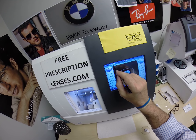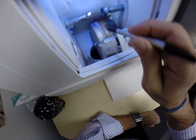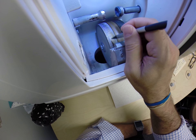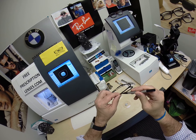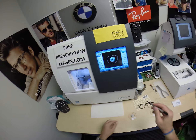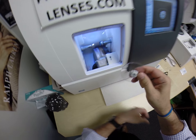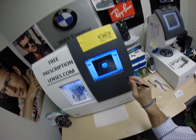I'm going to wake it up. That's job number 1478. The actual cutting wheel is this diamond-crusted wheel that's going to grind away your lens material until it's the final size. This wheel in the center is going to put the V-shaped bevel onto the lens so it stays inside the bevel of the frame. I'm going to go ahead and let the magnet do its job a second time, press that on there firmly, line up the magnet, and hit start.